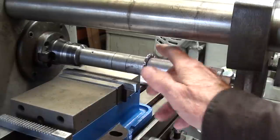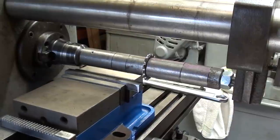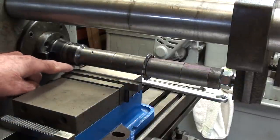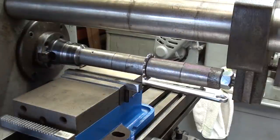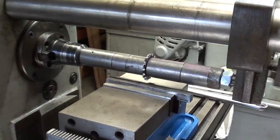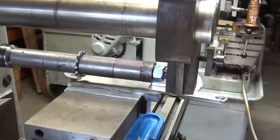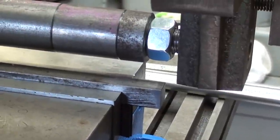I've got the cutter in there. Now, I'm not going to make this today. This is just the arbor. But with it in that position, you can see that it can be a problem touching here if I raise the table too much, but I think I've got the clearance that I need there without actually measuring. And then moving all the way out to this end, of course, the last tooth won't be right on the end, but you can see that I have the reach that I need there, but just barely, and it wouldn't be another tooth or two, and I would strike right here.